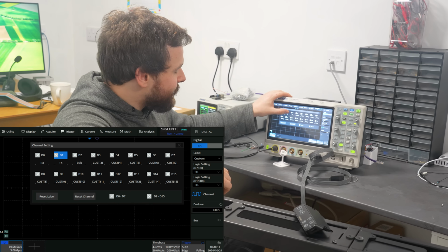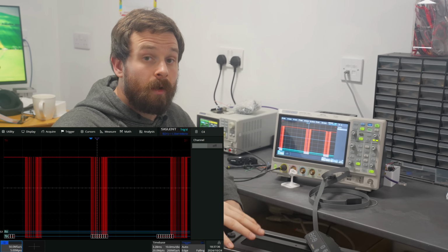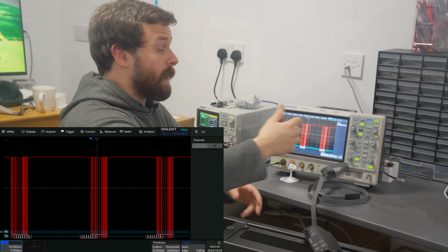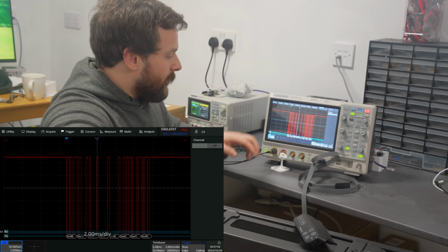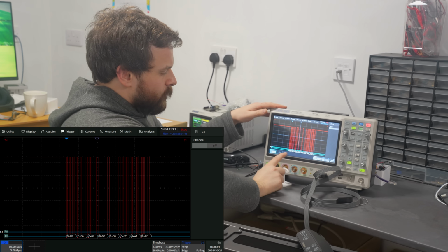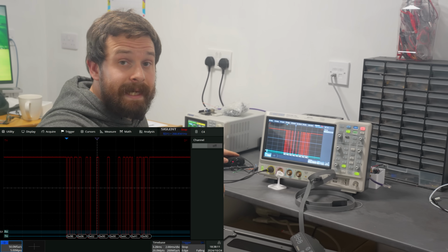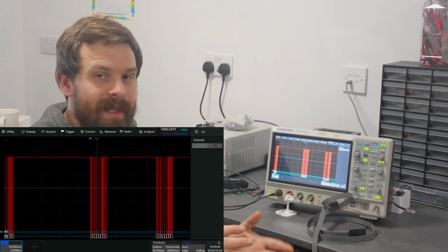Now, if we enable the TX line on our oscilloscope, you'll see that immediately, even without the desk moving, we are getting a lot of constant traffic through our controller that is being displayed on the TX lines, which is most likely a heartbeat or a wake up type of signal. And if we try and actually capture one of these heartbeat signals, and then we zoom in on one of the waveforms, you'll see that down at the bottom, our oscilloscope is decoding the signal for us into bytes of data, which we can see is transmitting 9B06020006CA19D. Which means that we are getting some reliable data through our oscilloscope, and we're seeing information that makes sense. But we aren't actually interested in the heartbeat data per se.